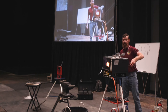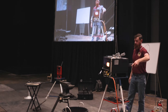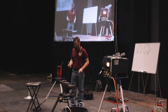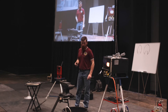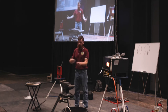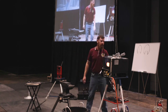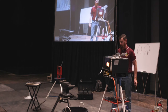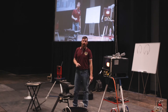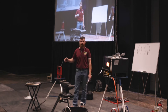I found that concave shoes is what pretty much taught me the most about forging. Ironically, there's not much forging in concave shoes, because the biggest thing that it taught me is that self-awareness of knowing what I'm doing, and my perspective wasn't accurate, right? Concave is one of those steels where if you're not consistent with what you're doing, in doing it with intent, it's going to get all kinds of squirrely, unflat, and do a bunch of things. It makes it a lot harder to do what you're wanting to do. Okay? So when you're starting out making shoes, breaking them down to a simple task, knowing exactly what you're going to do per heat is crucial, because then you can duplicate it consistently, and then you can increase quality, and once that happens, then you can start taking heats out of the equation, right?